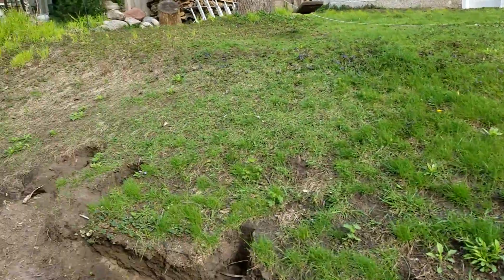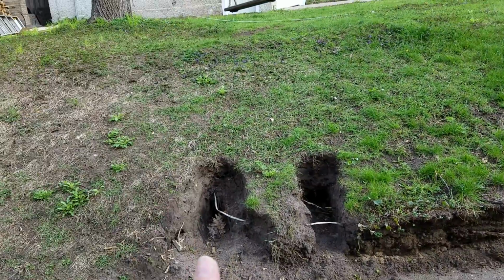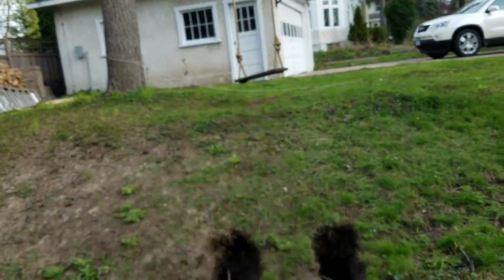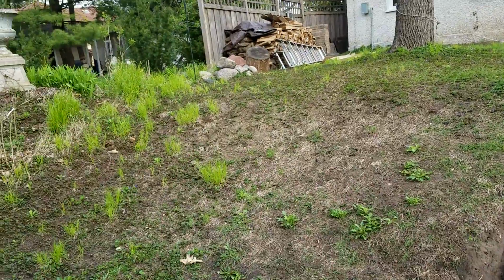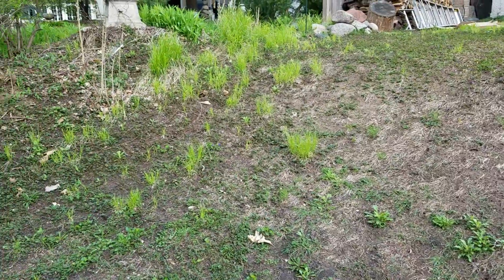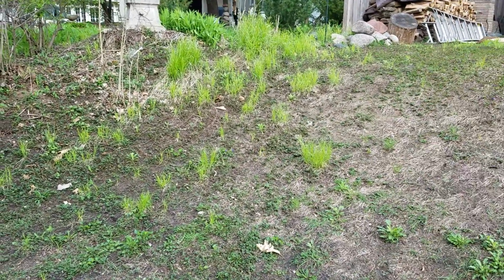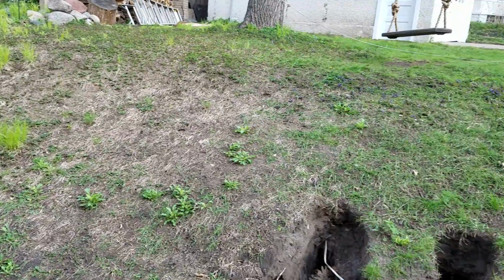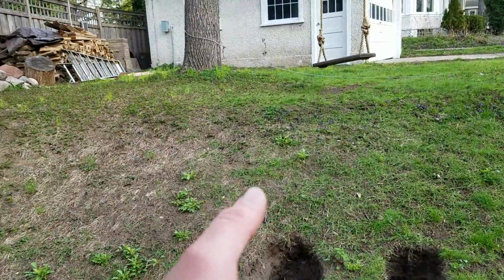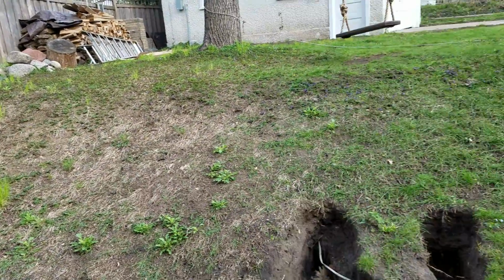All right, so we're going to bid to end it right here at the end of his patio. And we'll bid to have returns as well. But then as a line item, we're going to complete the rest of the way to the side of their lawn here. We don't need returns here because we'll just kill it into the height of the neighbor's yard. So we'll just build it over here and end it at their grade. It's not going to be a huge upcharge because we're not building returns here. We'll just take the return stone and put it over here, so it's only an extra couple feet.